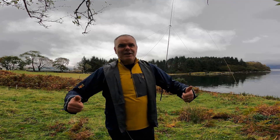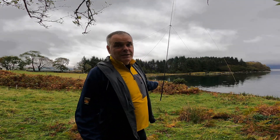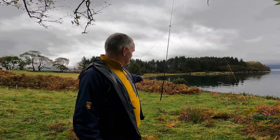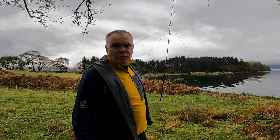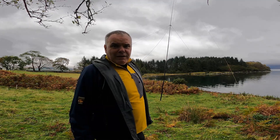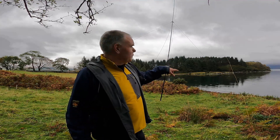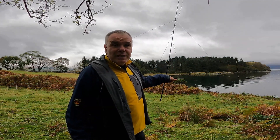It's up. I left the base — the second bottom section of the mast is still inside the bottom section — so it's high enough. The feeder's hanging about three feet off the ground, almost a metre. I'm going to tie off the ends and then hook up some coax and get the MFJ on it for a quick test.